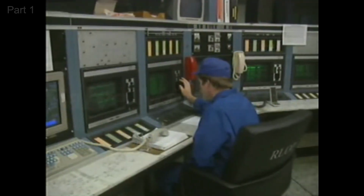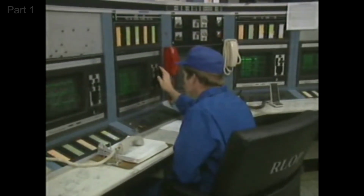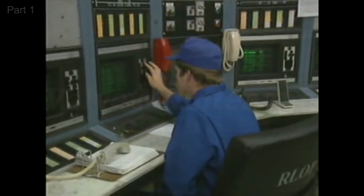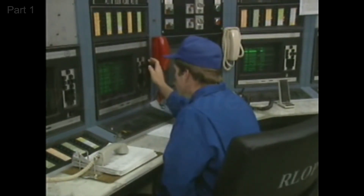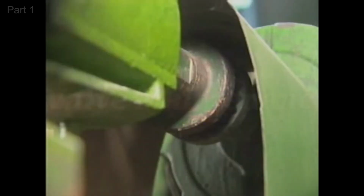One of the advantages of using a contactor is that it can be energized from a remote location using a voltage that is lower than the voltage that is used to energize the motor it controls. This way, the person operating the motor does not have to get close to high voltage when they start and stop high voltage motors. Other electromagnetic switches used in controllers are usually called relays. The construction of contactors and relays is basically the same. In general, though, relays are smaller than contactors and carry less current.